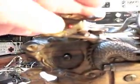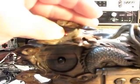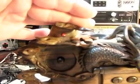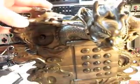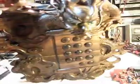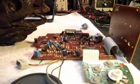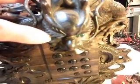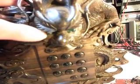There's another light here. It's a red light, and I suspect that that's for when the telephone rings, that kind of flashes red. And so basically that's what you have to worry about on these speakerphone boards. You have to worry about being able to get these. You're taking a board that didn't have exactly what the board that was in it had, so you have to find a way to utilize these lights and get these lights lit. So there's a lot of work to it and a lot of things you have to think about.